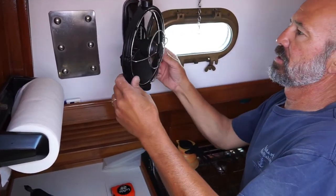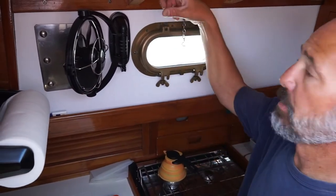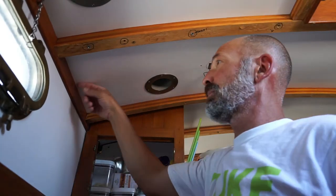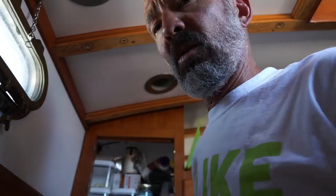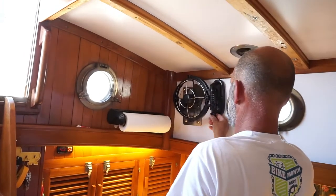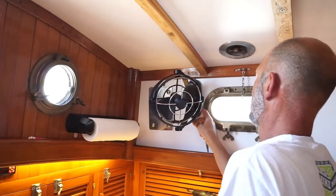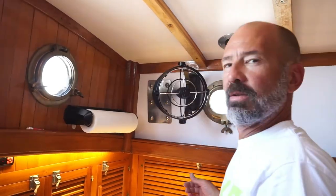When you're standing sweating in the galley you can turn it this way or that way. I haven't got the wiring hooked up yet, so I'm going to run it into this area right here. Got the wire chased in - it comes down here, runs behind here. I had to take this strip down to the shed and route out a little channel on the back to guide it down to the new fan wire location. Got a couple of wires to hook up, turn all the breakers back on, make sure all the lights work.